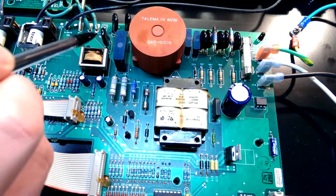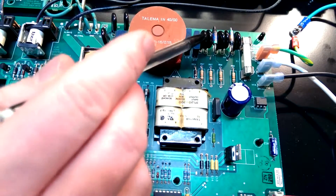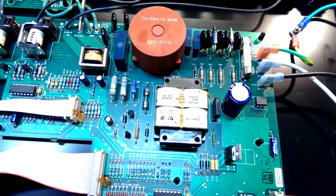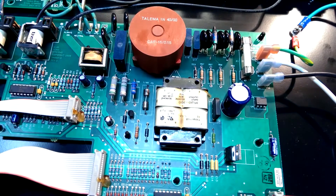I'll probably go through and replace all the MOVs as a precaution — I have spare brand new ones in stock. This is an older unit; I see a date code of 2000, so it's roughly 16 years old from when it was built. It could have been used barely at all, but it's hard to tell. As a precaution I'll just replace them all anyway since I have them and I'm not using them.